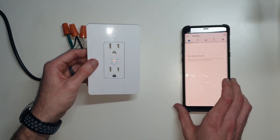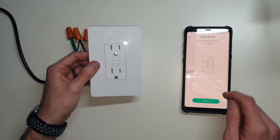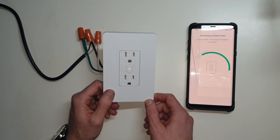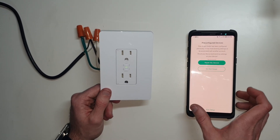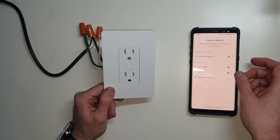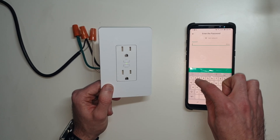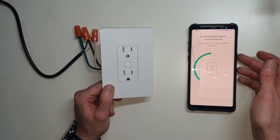Let's turn the light back on and hop over into the application. Let's go ahead and add a device — we want to add the new KP200 smart outlet. We're already all wired up and it is flashing orange and green. Now it's going to search for the wireless signal that the outlet is outputting so that it can connect to it and send the Wi-Fi credentials that we want it to connect to here at our house. Where I previously had it configured, it had remembered that, so I'm going to reconnect it to the test network I've got set up. The password is very secure — 'test pass' — that is not a good password, so don't use that. Let's tell it to join the network.